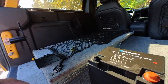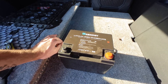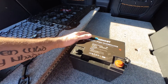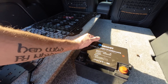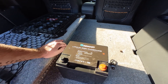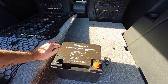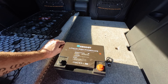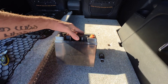One other thing I forgot to mention about the battery: lithium iron phosphate basically has the same usable capacity as a 100 amp hour lead acid, AGM, or flooded battery. The thing about lithium iron phosphate is you can use pretty much all of those 50 amp hours. With a lead acid battery, if you discharge past 50 amp hours — half its rated capacity — you start doing damage to it. Keep doing that repeatedly and your lead acid battery will be junk before you know it. With lithium iron phosphate, you just run it down and bring it back up — it's probably got 500 to 1000 usable charge cycles.